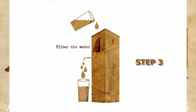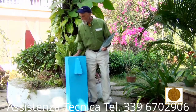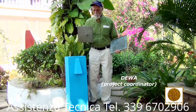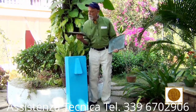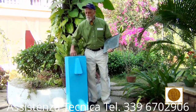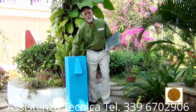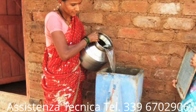Let's look at how simple this water filter is. The first thing you see inside the filter is this diffuser plate — it's a galvanized plate with an array of little holes in it. The reason for the diffuser plate is to keep the inrush of new water from disturbing the sand layers in the filter and the biological film that develops on top of the sand.